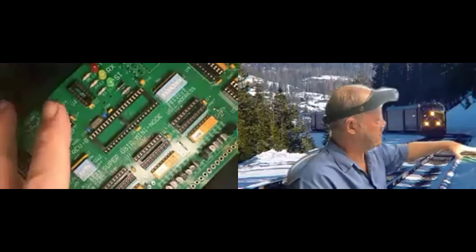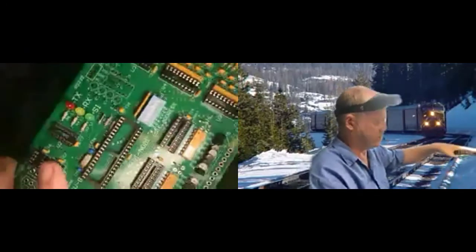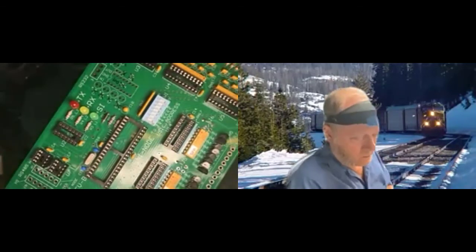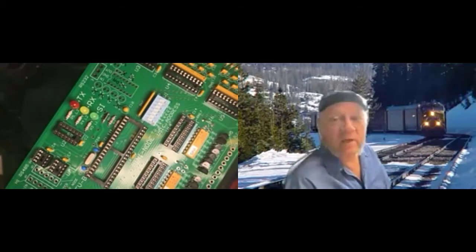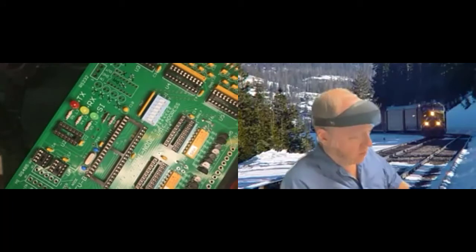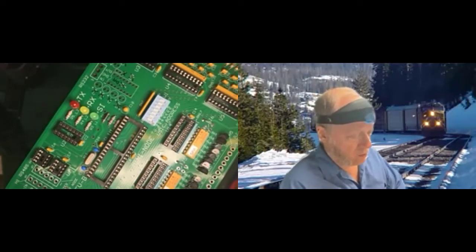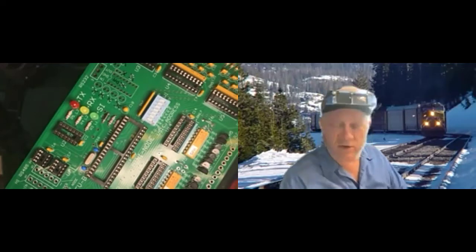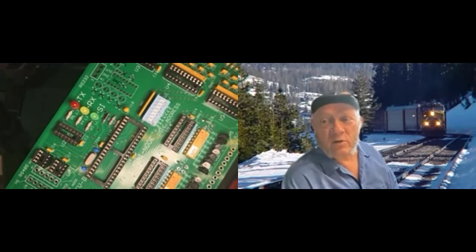You know, sometimes when you can't wait for the delivery, you can use a toothpick to apply a very tiny amount of paste flux. Yep. And also stranded copper wire as a substitute for the braid to remove excess solder. Nice. The professional braids actually have a tiny amount of flux put on them, and that makes it a little easier. But yes, stranded copper wire would work, particularly if it's braided loosely, so there are voids for the solder to flow into.